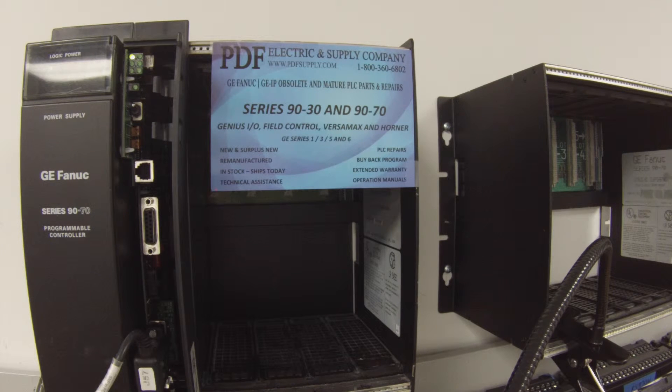When that screen opens up, go to Clear, and a window will pop up called Clear Memory. All you want to do here is clear the controller fault table and I/O table — that's the bottom two selections. Don't select anything else because you could risk losing information on your processor. I'm going to click Yes to clear that information. Once it's successfully cleared, I'm going to Download and Run. This is blank information — blank empty slot racks, just a CPU. It will ask what you want to download to the controller: just hardware configuration and logic, the top two selections. You do not want to write initial force values or write any information to flash memory.